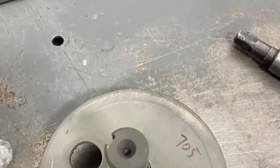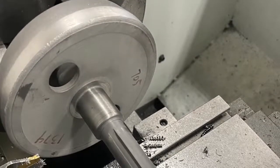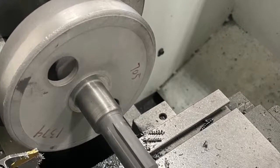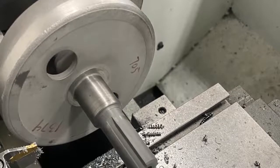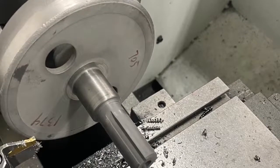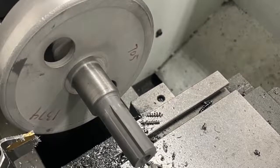In the next slide here, we have our center drill. There's already a center drill point in the end of the sun gear, and we're just going to make that a little bit bigger so that it accepts our drill. We've already looked up the drill and the tap for a 5/16-24 thread. That's what we're going to use to tap the end.